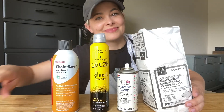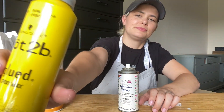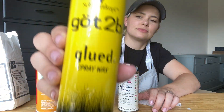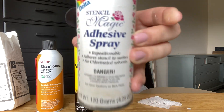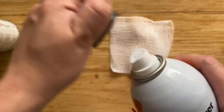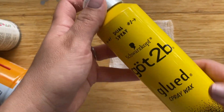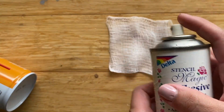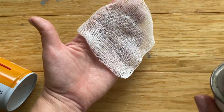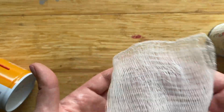I'm giving you my money-making secret — my special recipe, so give me a follow if you're going to try to copy this. I use chain saver wax-based lubricant. After a lot of trial and error, my DIY tack cloth recipe uses three things: chain saver spray wax, a two-in-one spray wax for hair, and stencil repositionable adhesive spray. I'll link all this stuff in the description. First apply the chain saver spray wax — it's a dry wax, like a dry oil used to lubricate joints. Then apply the hair spray wax, and last the stencil repositionable adhesive.